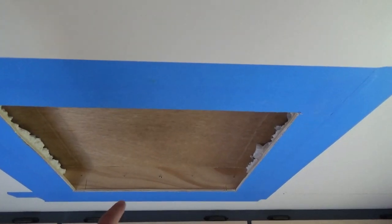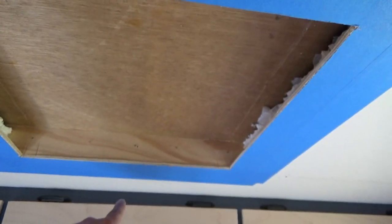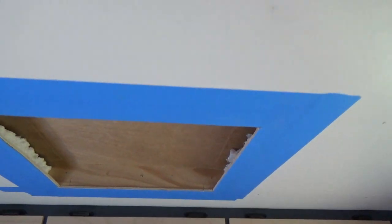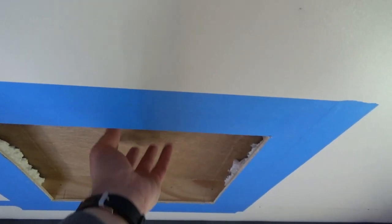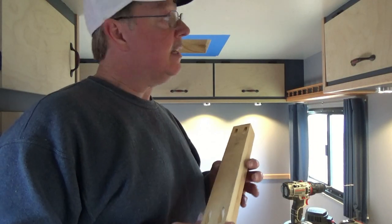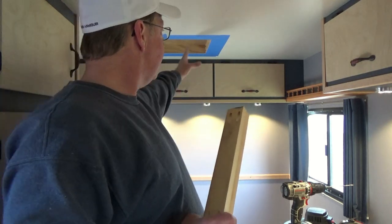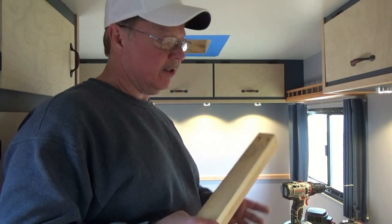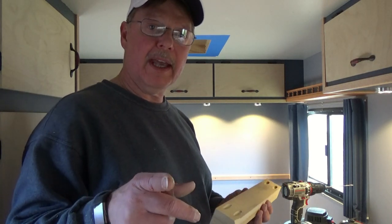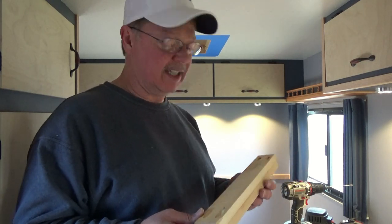Before I do that, I need to drill a hole through here to run a wire behind my cabinet. Once I get that and can fish some wires through, then we can knock a hole through the roof. Because I didn't anticipate putting a fan in the ceiling, I didn't have it framed in — so what I'd recommend is, even if you don't think you'll ever put one in, go ahead and frame it anyway. That'll save you a little time.